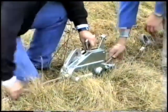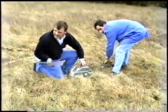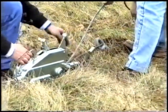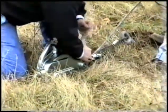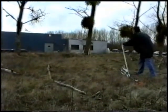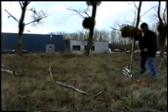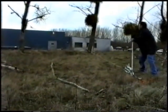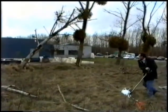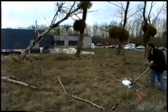The Tirfor is released and the wire rope inserted with the loose rope pulled through to save time. The machine is anchored and engaged. The telescopic operating lever is fitted. Operation is very easy. The load may be controlled with great accuracy. For reverse operation, just change the position of the operating lever. Notice that whenever you stop operation, the load is held securely.